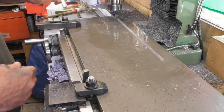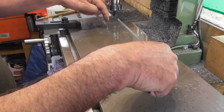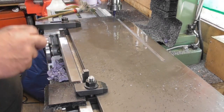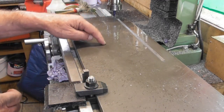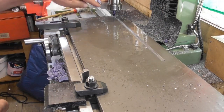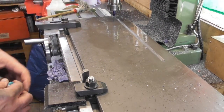That stack fits in that T-slot and that stack fits in that T-slot, just on the other side of the clamp. I can't get clamps on the far side. As I slide the material along I've got to use two clamps on here. This is the second one of these I've done and so far so good. I'm running a cut along as far as I can — half a mil off finish size. I'm taking 3.5mm on the first cut then dropping down to 6.5mm, which is the second cut.